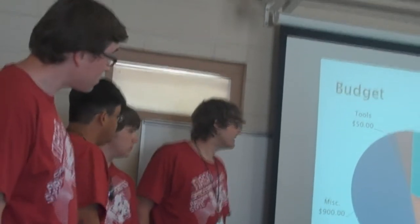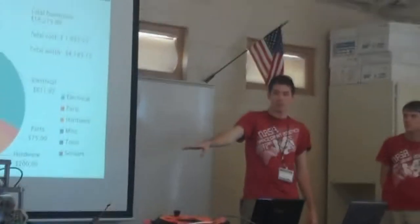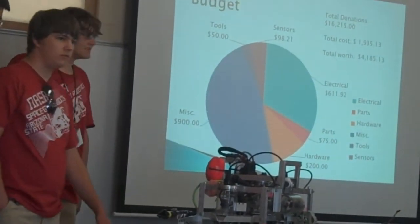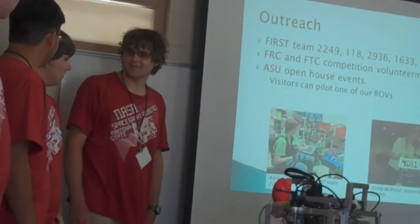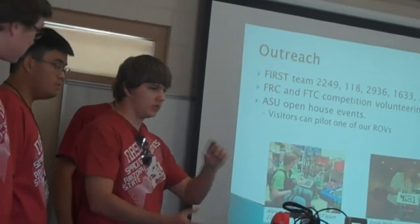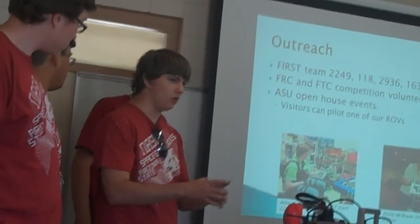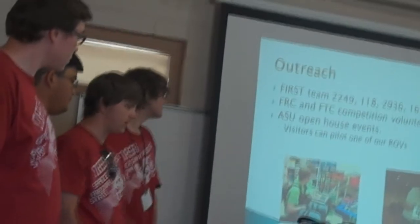Yeah, total cost. One area that we save in a lot too is we've machined the frame itself, so we don't have to pay anybody else for the man hours to make any of those parts. Yeah, our team actually gets certified in the club, and we machine all our O-ring grooves, all that ourselves. And these aluminum pieces are turned out of sometimes square, large pieces. Especially on the torpedo, we took a big acrylic sheet, it was like 3/4 of an inch thick, and we took the bandsaw, cut it in a rough circle, and turned that down on the lathe to a perfect circle that we can then print over and have a seal.